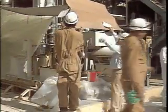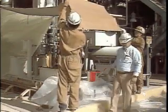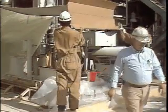This temporary enclosure is very important in the case of extreme cold or hot ambient temperatures. If the ambient temperature is below 65 degrees Fahrenheit, then it is necessary to heat the surrounding area, and likewise during the hot summer months to prevent the sun from providing excess heat to the foundation and pump baseplate during the grout pour and while the grout is curing.